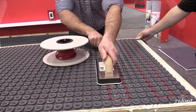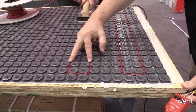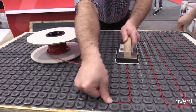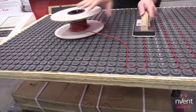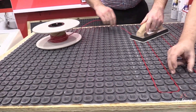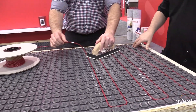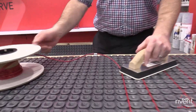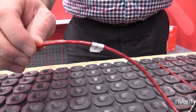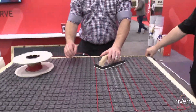That spacing is the same wattage output as the standard mat installed over there. The 2-3-2 spacing means two pillars, then three pillars, then two pillars. We can also go to 15 watts per square foot with consistent two-pillar spacing — rather than the staggered 2-3-2, it would be two pillar, two pillar, two pillar. We're now halfway through the cable — there's an indicator on every cable kit to let you know, so it's a good time to make sure you have enough cable to finish the job.